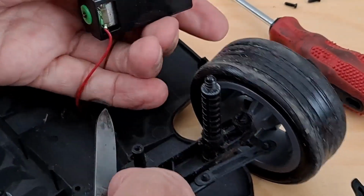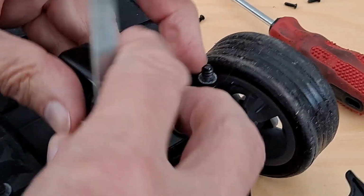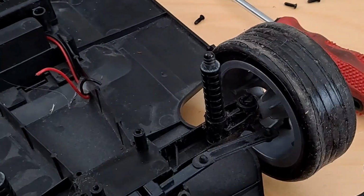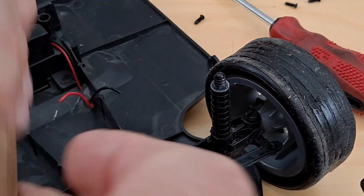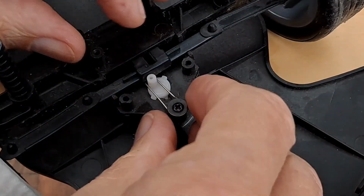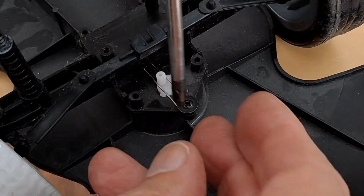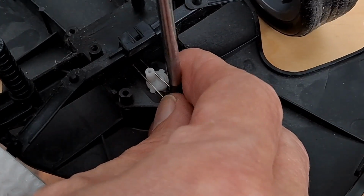Okay, oh, that's inconvenient. I've just broken that wire off moving it around. Well, in fact, I'll pull the other one off anyway, because if we're going to stick a servo on here somewhere, we don't need that anyway. Right, if we're going to put a servo on there, we won't need this spring return. Oh, you can't see it because the camera's not pointing in the right direction. What I'm just saying there is we won't need this spring return to get us to the centre if we're using a servo to do the job. So we can undo that and take it off.